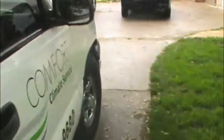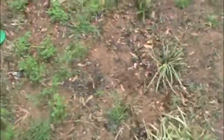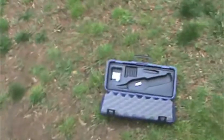We are out on a no-AC call — we're definitely low on refrigerant. When we came up, we were probably about 50 PSI. I went ahead and put some nitrogen on it to get the pressures up so we can find this leak.